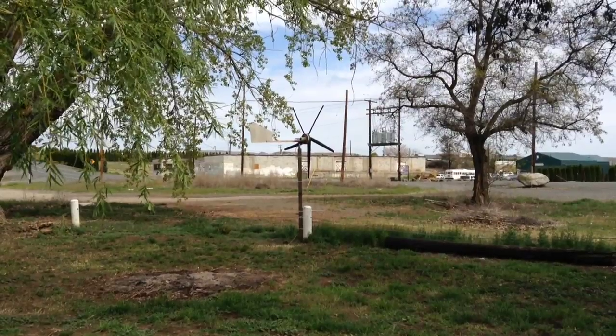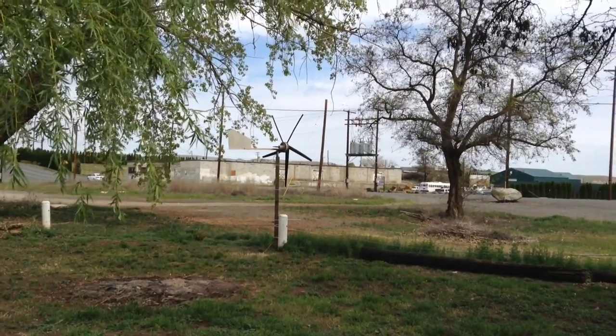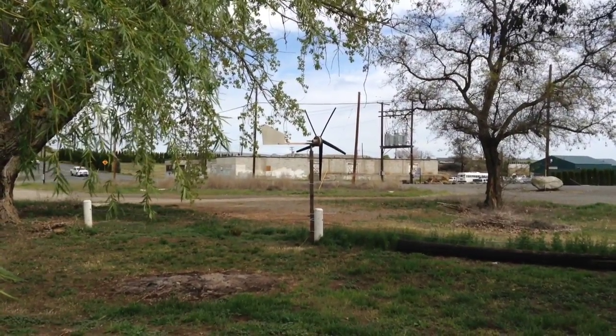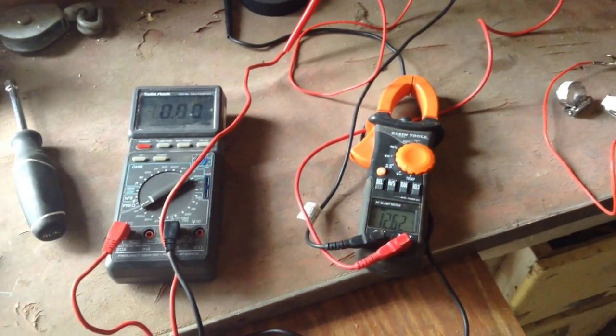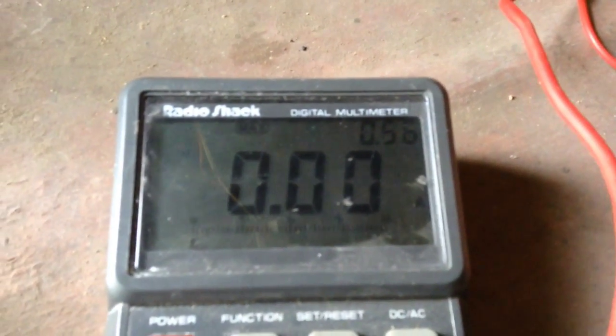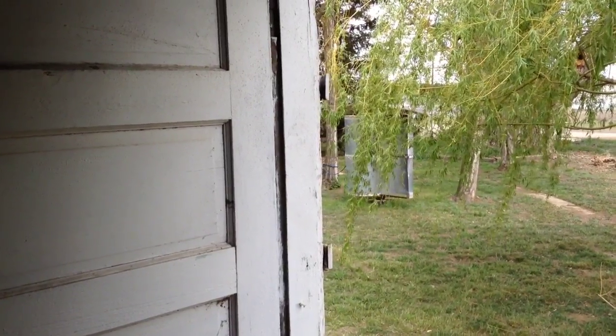So today it's about 12:30, and we have winds of a maximum of 6 miles an hour. As the day progresses up until around 5, we should get winds of 15 to 20. I got everything wired up so we can get some amperage and voltage readings. The battery is resting at 12.6, and I have the ammeter in line so it'll read what's going into the battery. Just in this 5 to 6 mile an hour wind, we've already hit over half an amp, which was real hard to do with the Savonius wind turbine. I had it wired back to the factory setting so at a slower rotational speed the generator would produce high enough voltage to actually charge the battery.